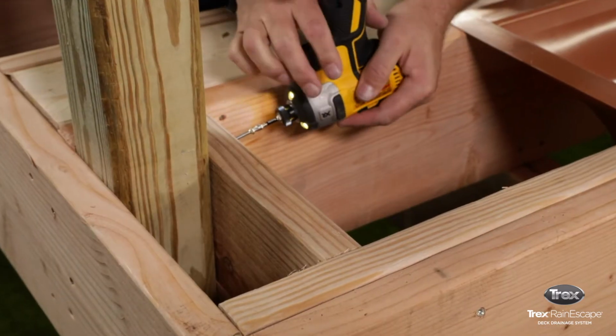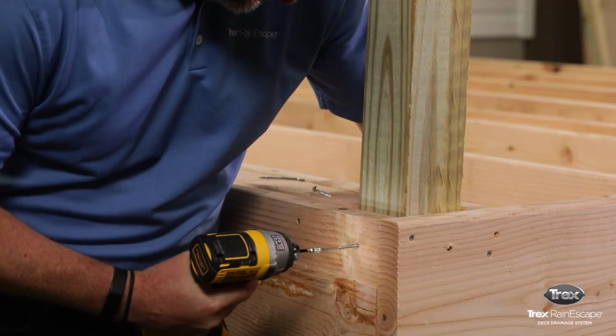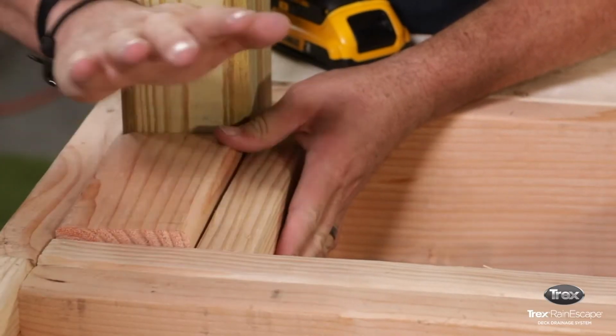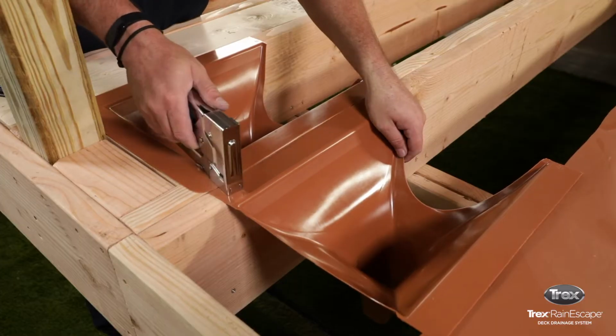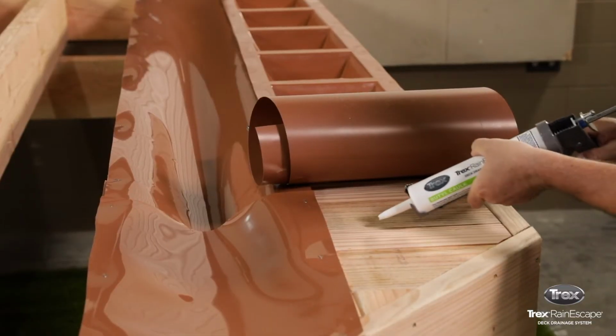Cut vertical cross blocking and install it to pinch the post into place so the post can be installed according to the manufacturer's instructions. Then cut a 2x4 the size of the opening. Screw the 2x4 flush with the top of the joist. Now you must decide if you want to cantilever the rest of the bays or fill in and flat block.